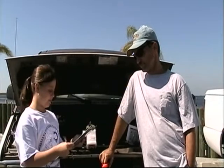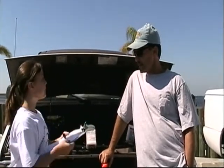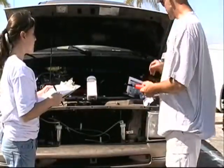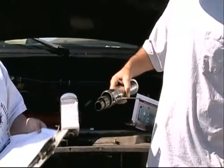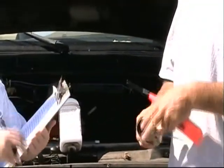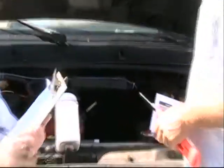I want to ask you a question. So, what did you bring today? I brought my hydrogen generators. This is an example of one of my hydrogen generators. You can see the inside — it's a multiple tube design. This is one that I've been using for two months. It doesn't produce any mud, which is iron oxide. It also doesn't overheat.